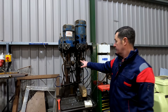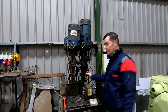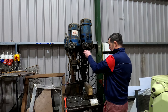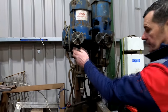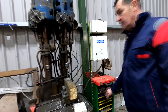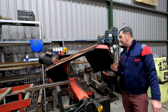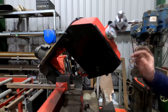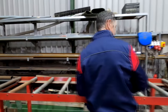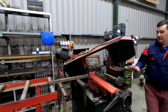On any farm you need to drill, so we have a two-post pillar drill. If you want to do a bit of pilot drilling you drill on this one, and if you move to the next stage you can finish-drill on the second one — very handy to have the two. You can select your different speeds. He has all his drill bits in the little drawers there. We also have a bandsaw — a great piece of equipment, very handy. You can cut at different angles or straight. It's essential to have some sort of infeed rollers to keep the material level going in, and a roller and stand coming out. All the equipment here is three-phase.